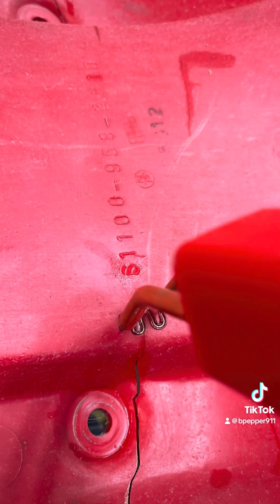I usually put a little twist at the end before I pull the staple. Squeeze the trigger — we get some heat, it's sinking down in there. A little twist, a little off the trigger, pull it out, let it cool. That, no matter what, should keep that crack from spreading any further.